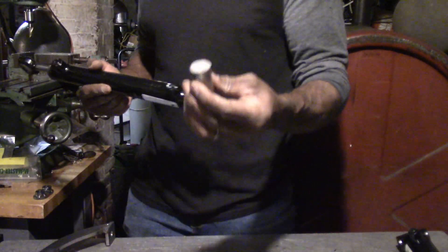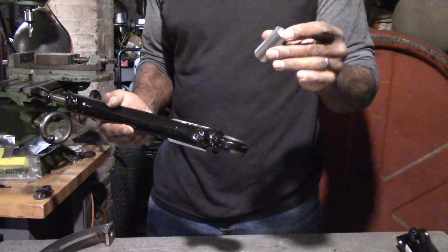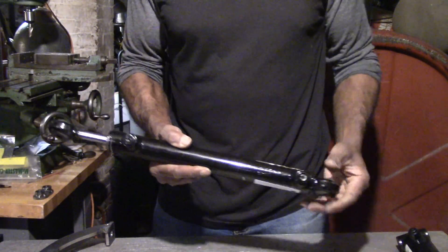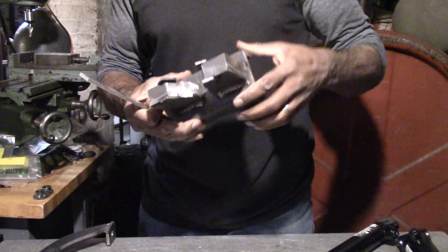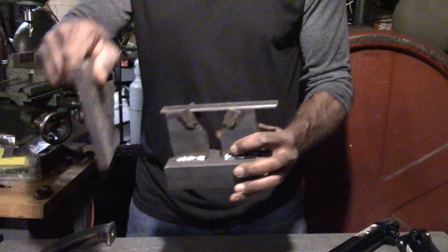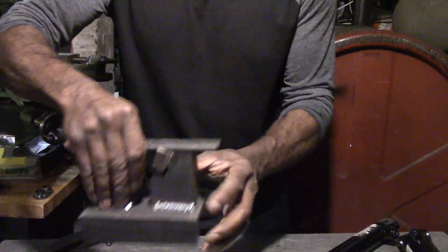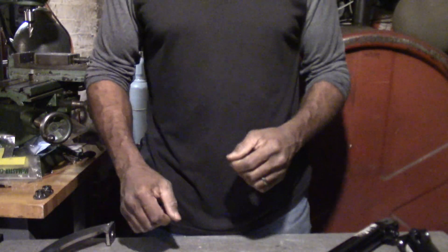For the cross tube, I'll use this piece of one-inch diameter, or 25-millimeter, rod. I'll bore it out in the lathe, and after this is cut off, I'll weld it into place. And for the clevis end, I'll use this jig that I made inside of my hydraulic shop press. This piece of steel strap will go in it, and this rod will be pressed down by the hydraulic ram and it'll bend into a U-shape in this groove. Then I'll weld it in. And once I do that, I'll have the custom cylinder that I want.